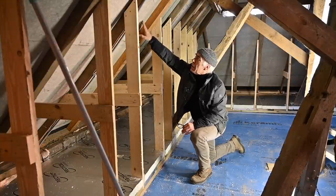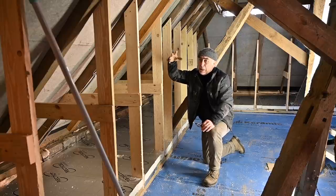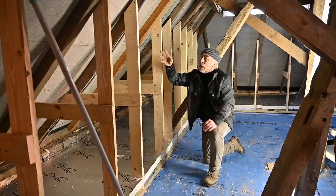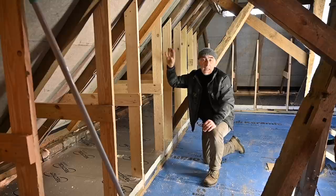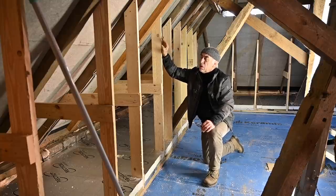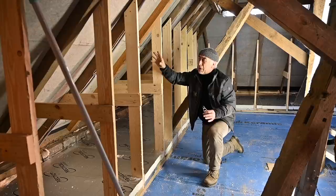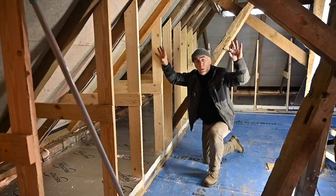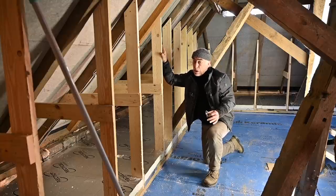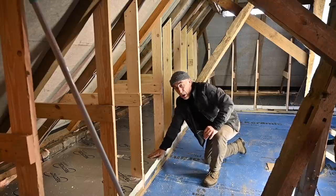You can see this gray part here — this is a waterproof board, but when I say waterproof I mean it can actually let humidity through. So if you get a lot of small snow coming in and it blows underneath the slates, you might see this getting a little bit wet — not dripping, but wet. Now if you were to insulate those rafters, you'd create a damp area. I don't like that. It can breathe, but it'll still be a little bit damp. I'd rather leave the whole structure free so it can breathe, since this is a non-user room anyway. That's why I'm insulating the floor of the tower room and also the top of the walls.